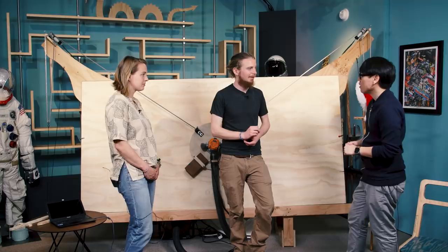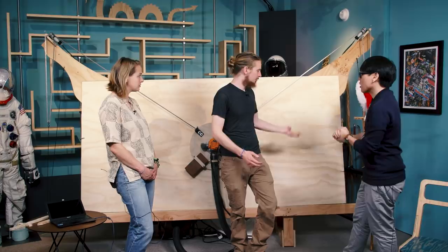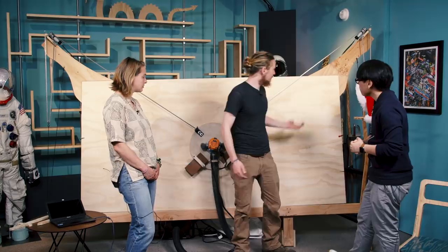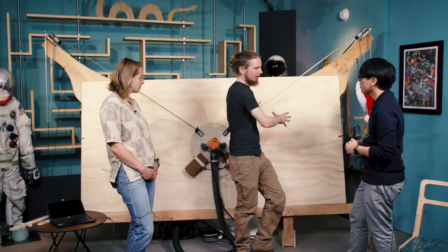You're actually mounting your material directly — is it locked into the frame with like a jig? Because the base is also 4x8, you can just clamp it with regular C-clamps to the edges. The registration of this piece is actually not quite as critical. Having exact registration between this and the frame itself is very important, but if you shift the material a little bit, it just shifts your cut. You don't get a distorted cut or anything weird and unexpected like that.